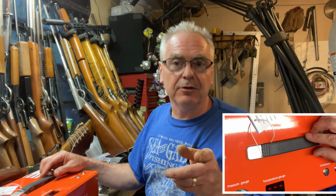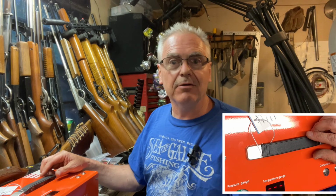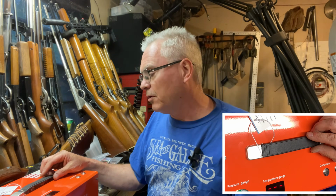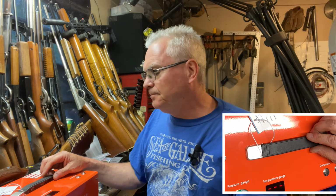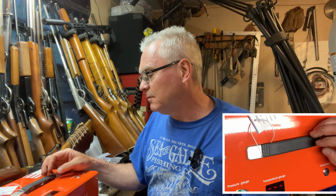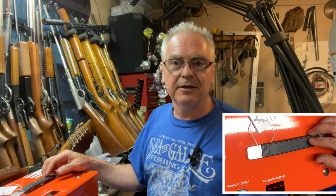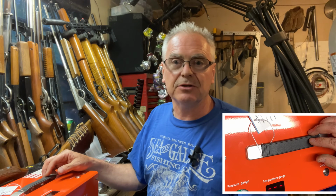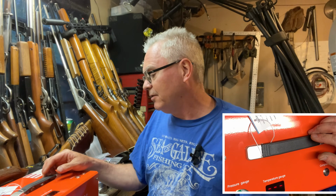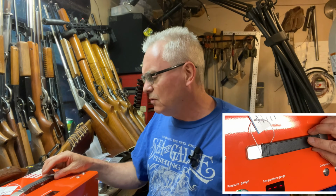And even during those 25-minute cycles, the temperature stayed right around 30 degrees Celsius, got to a max of about 31.4, 31.7, which is just phenomenal. I mean, that's less than 90 degrees. The Hots on Volt, even just free running, within less than 10 minutes, it reaches 195 degrees Fahrenheit, and you have to shut it down. The manual says never to let it go above 190 or 195, one of those two.